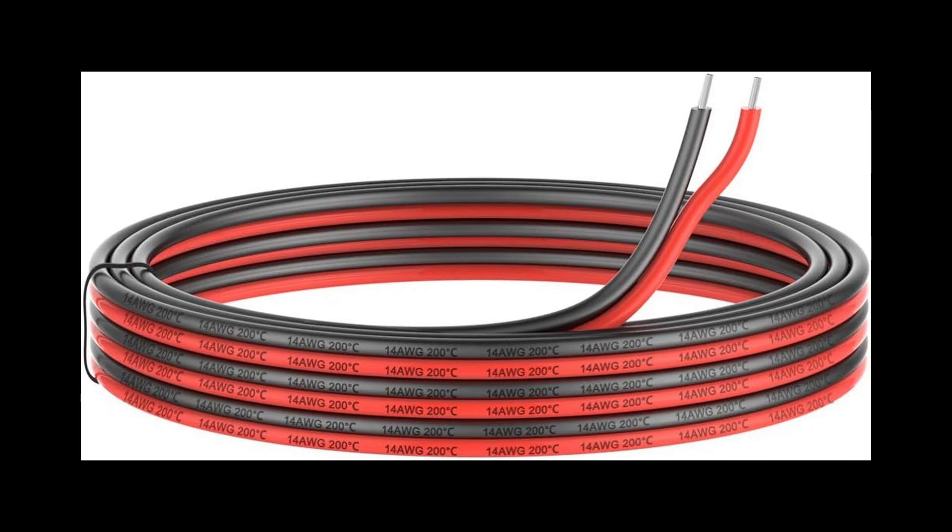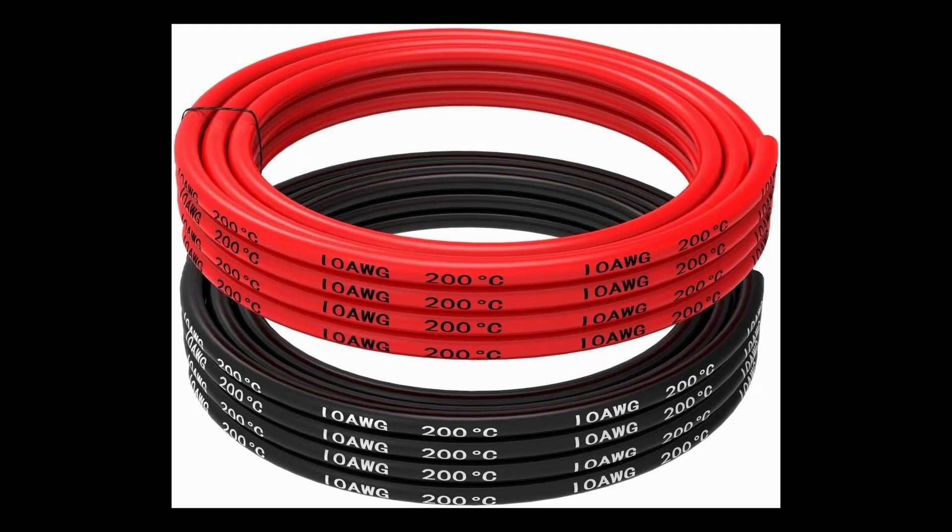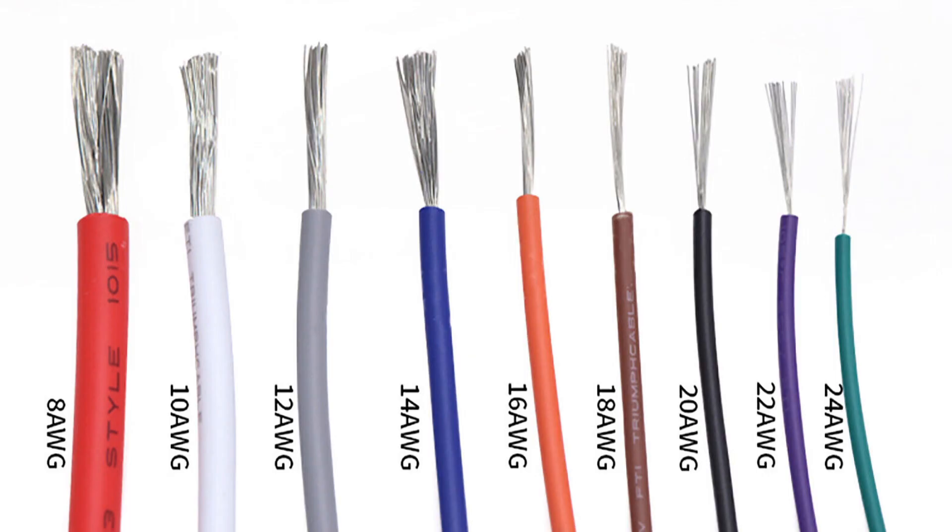For that you're going to need good cables. Here I'm talking about the difference between an okay cable — 14 AWG, so 2.5 millimeters squared — and something like 10 AWG, which is 6 millimeters squared. Quite a lot thicker and a little bit more unwieldy to use.